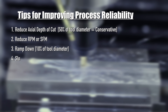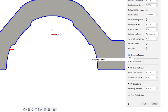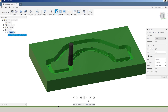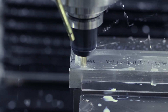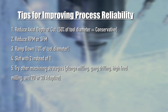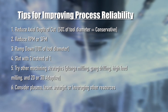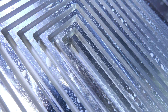Number four: slot with two slots. Instead of slotting a quarter inch slot directly around your part, slot a quarter inch slot as well as another one about 20% of the tool diameter outside of that slot. It's going to require two passes and eat up a little bit more material. But by doing this and alternating on depth in Fusion, you're never really slotting as you step down, and you're going to really help aid in chip evacuation — especially with something like a Fogbuster where the air blast can blow chips out so long as there's room for them to maneuver. There are other ways to do this than actual slotting: plunge milling, gang drilling, high feed milling, and good old 2D or 3D adaptive. Don't overlook plasma, laser, or water jet — even if you don't have one of those machines, it's never been easier to leverage websites and resources to send that work out and have parts brought in-house.